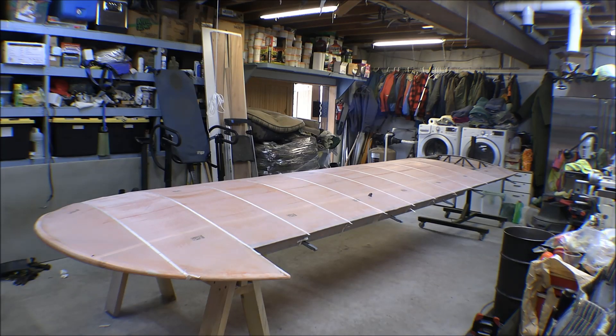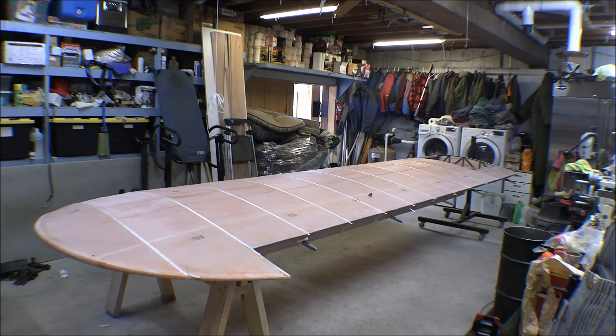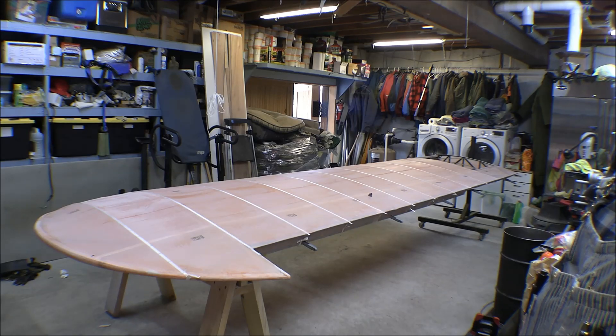Now one more step towards finishing that wing. That was a pretty big job doing the rib stitching — I think I said 217 stitches in there. Now we got to move on to the next stage. We got it down flat, and I'm going to work on the top side of it now. The first step is to go over it with AcrylaClean and wipe down around all of the rib stitching and lacing to get any of the residual wax off.